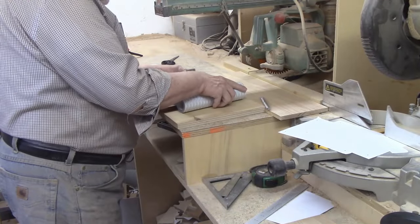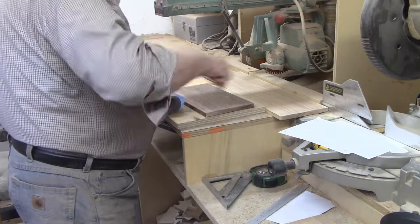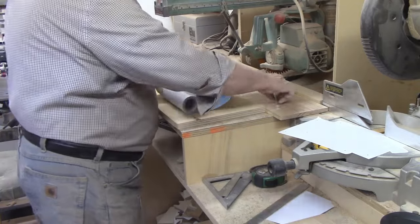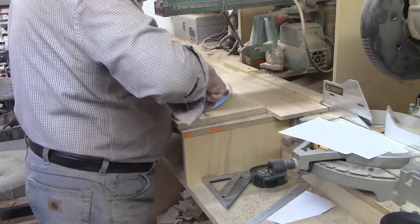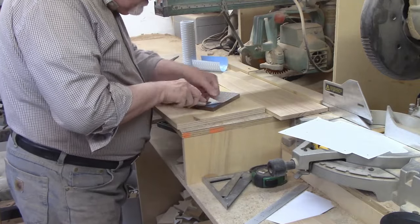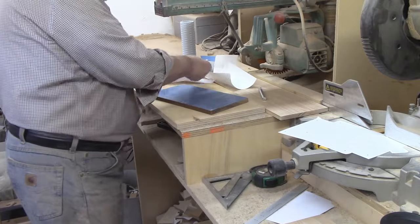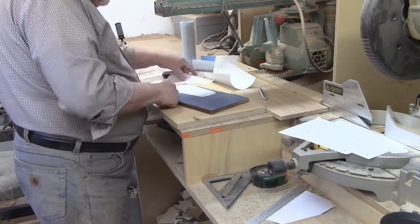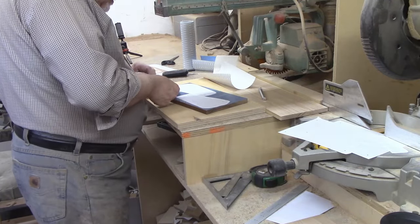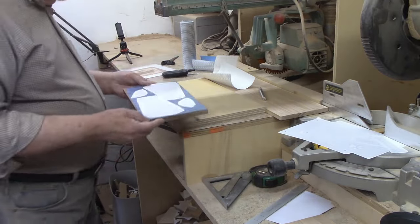The plans call for half inch material. I had a piece of four-quarter walnut that I planed down to half inch thick, and I can fit two sets of dog bodies and tails on this piece. I had a piece of half inch red oak on my shelf that's large enough to make two backer boards. I'll use scroll saw tape to attach the patterns to the wood — you roll off the double-sided transparent tape onto the wood, cut it to width with a utility knife, peel off the backer, and place the patterns on top. The tape holds the patterns firmly while cutting but peels off quickly leaving no residue.